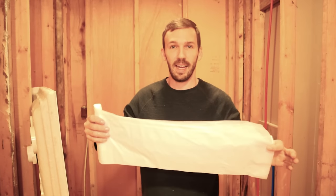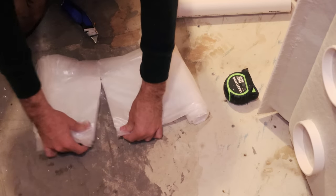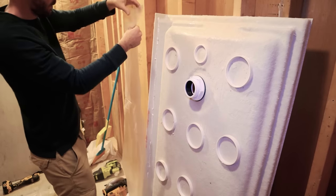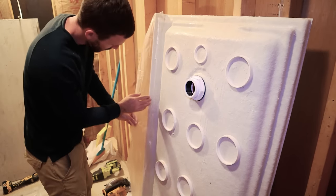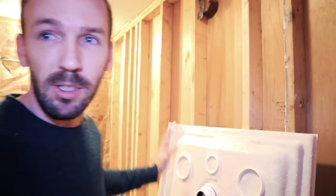This is a little bit of over-engineering, but I want everything I do to last at least my lifetime. This will act as a water barrier between where the pan meets the subfloor, giving it another three inches or so for water to wick away. That's a common soft spot where water seeps through and gets around your floors even if you put a bead of caulk around the pan, so this is just one more method of mitigation.